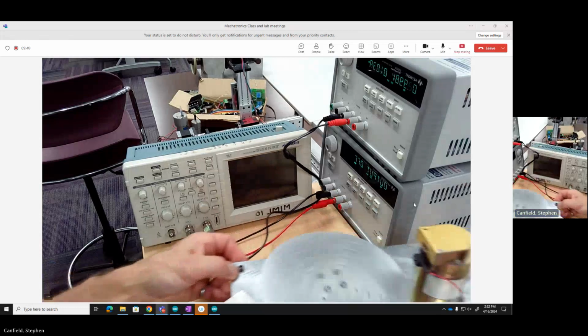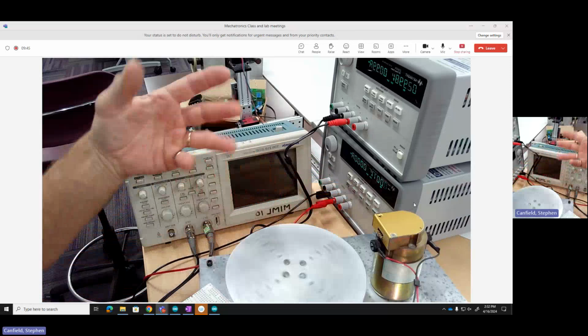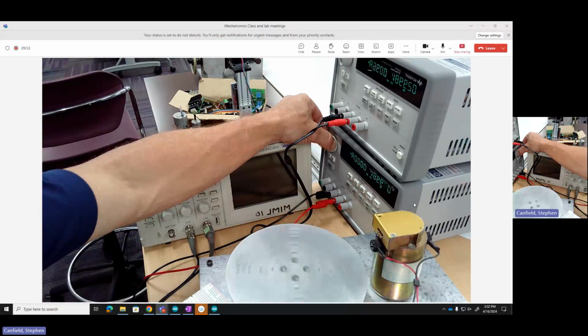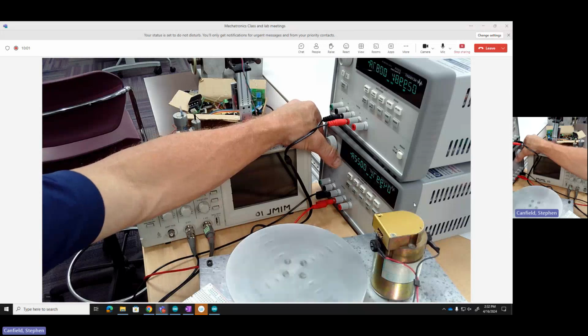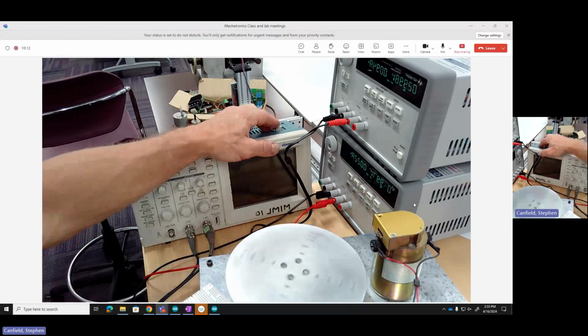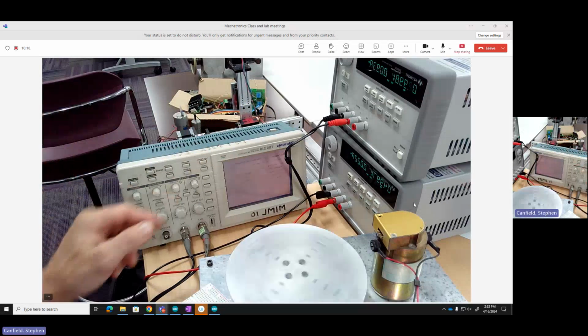So you can see it running around. And then I'm going to go over here. I'll turn my output on. Since I'm running this IC device, it'd be nice to have my current limiter. I'll just carefully watch my current to make sure it doesn't go high. I'm expecting a small load at 5 volts. I'm seeing 22 milliamps. That's a nice low load. That seems very reasonable to drive this little encoder. So I'll let that go. And then finally, let's look and see if we're getting signals because I'm driving the motor. So I'll turn on my oscilloscope.